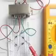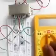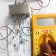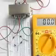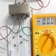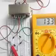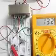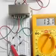We'll first take the AC reading to see how much the transformer is supplying. The transformer is supplying 13 volt AC. This is a step down transformer — 230 volt AC is being stepped down to 13 volt AC.